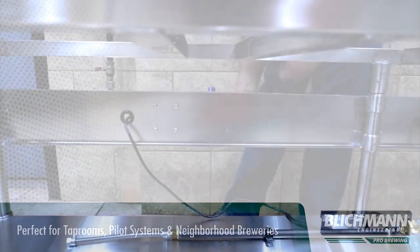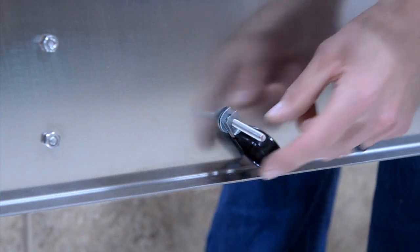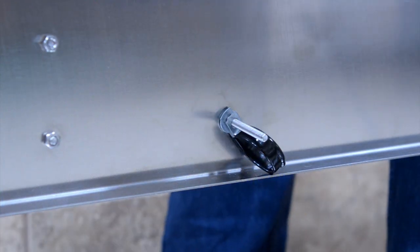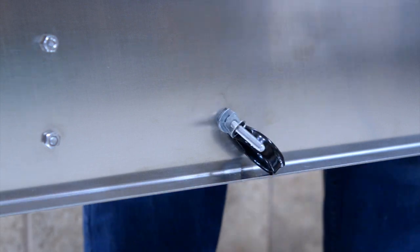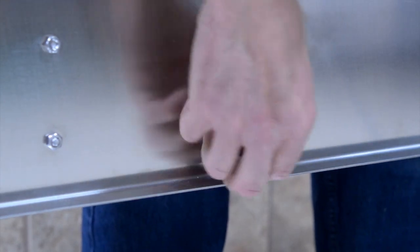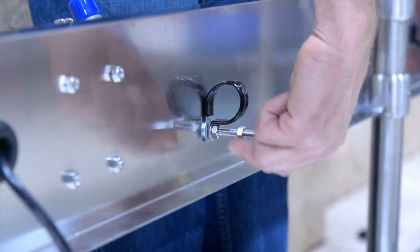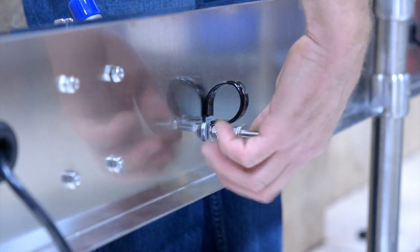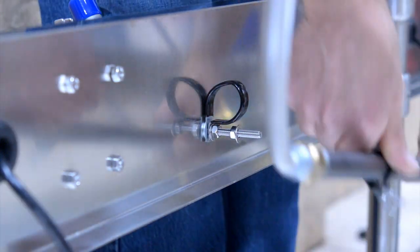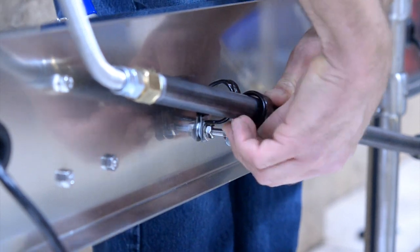On the square hole next to the right riptide, use the 2 3/4-inch carriage bolt and close with a 5/16 thick washer, 1/2-inch P-clip, 1/4-inch washer, and nut. Angle the P-clips upward for the cables to run through. On the same bolt, place a nut and 1/4-inch washer halfway down the bolt. Mount the P-clip on the gas manifold to the bolt and close with a 1/4-inch washer and nut.